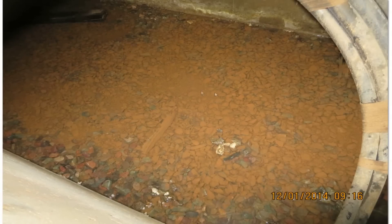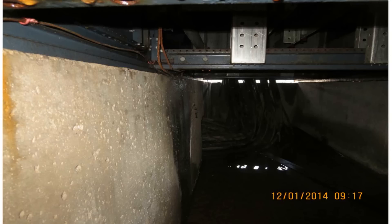Here's the bottom of this unit. There's a pit under there — all the wiring comes in through the sides of this pit. It's about three feet deep from the top of the concrete down to the bottom of the pit. There's a couple inches of water in there. This is our utility feeds coming in, and you can see a 2x4 down there — the water is just barely up to the top of the 2x4, so about an inch and a half to two inches deep.